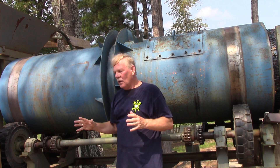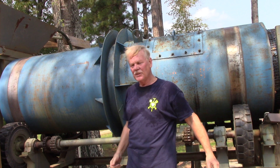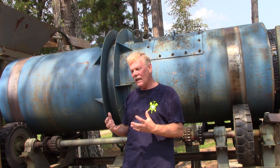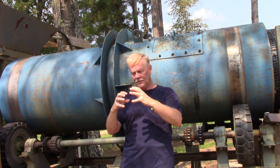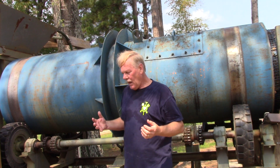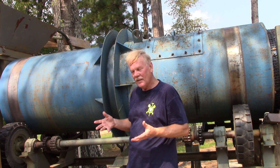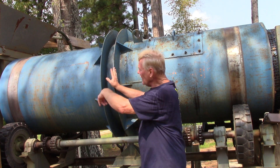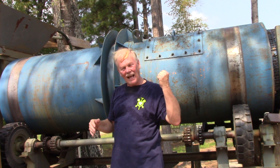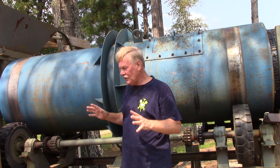This ore used to be one solid lump of igneous rock. It was so hard I couldn't dig it with a shovel, couldn't break it up with a rock bar. So the excavator came in and dug it up. As it dug, it broke it into big clumps and stuff that looks like dirt — but it's not dirt, it's igneous rock, just broken up. The diamonds will either be in these big chunks or loose in with the stuff that looks like dirt. So we put it all in here, and the big chunks are broken up by scrubbing around in this trommel, and everything breaks down to a small, like-size material that gets jigged together.